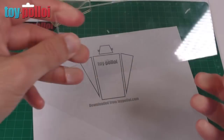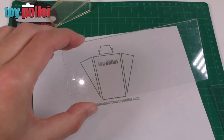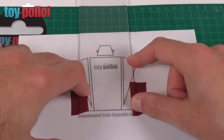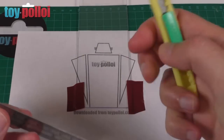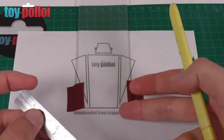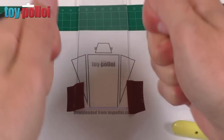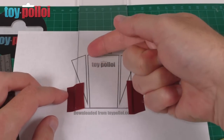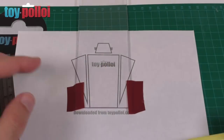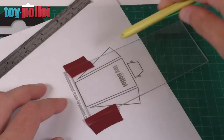I've got quite a lot of this sheet as I've been using it for other projects. I've taken the polycarbonate sheet and loosely stuck it over the top of the diagram, and I'm going to trace through using a metal ruler and a scalpel, scoring exactly on the lines. You want to go really quite neat. Once it's scored fairly deeply, you can just bend the polycarbonate sheet and it will snap along where you have scored. We're going to do this for all four pieces: the main panel, the two side panels, and the small bit that goes at the back where the hinge is attached. Score very neatly along these lines and cut out each piece.